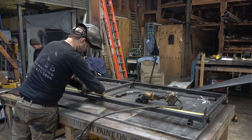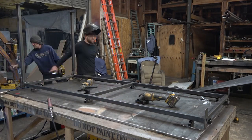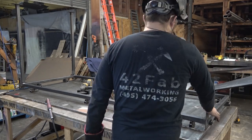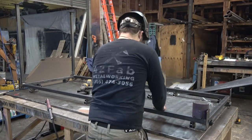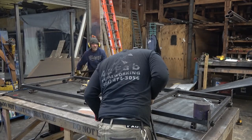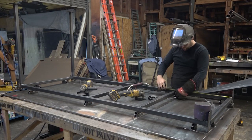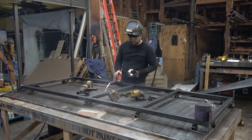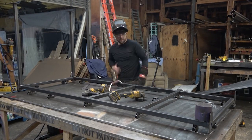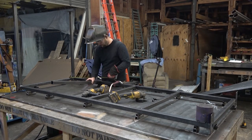The cycle time on this was about three minutes — pretty quick, and it's where you want to be. We're taking 60 L's, six cross members, and making 30 final pieces. Once the first assembled piece is done, we affix spacers to the table to hold it in place, then remove it and start very quickly grabbing pieces — one of each side of the L's and all the cross members — and drop them right into the jig, then weld it out. The jig is gold. It's worth every dollar of scrap steel to build it and every minute of time. It speeds you up and keeps you sane doing repetitive work.